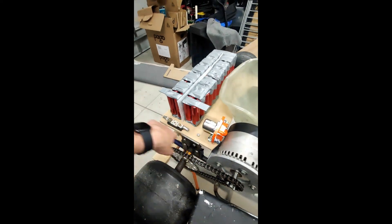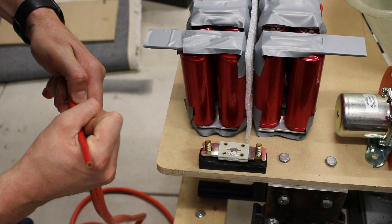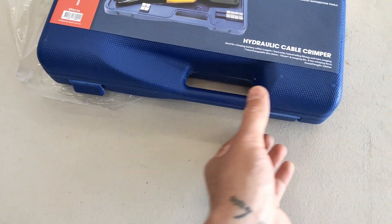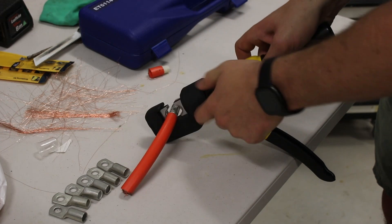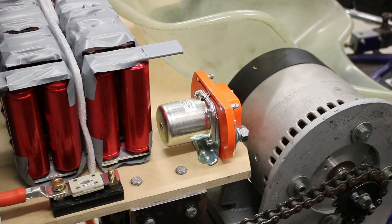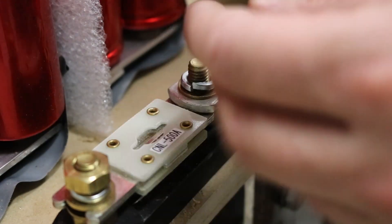I'm using Lincoln Electric Maxi Flex welding cable — it's nice and flexible despite being a 70mm² conductor, and should handle the power we're planning to run through it. I found an angle grinder was the best way to cut this cable since I don't have cable shears big enough. I got a bit of flack on YouTube for soldering the terminals last time, so I purchased a compression crimper for this build — it works really well. All the cable is the same colour so I used coloured heat shrink on the terminals, and they're looking a lot more professional already.